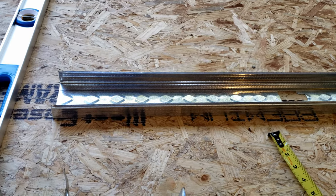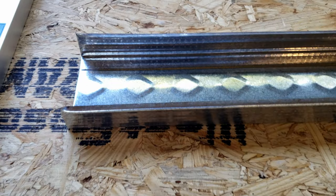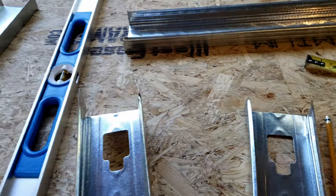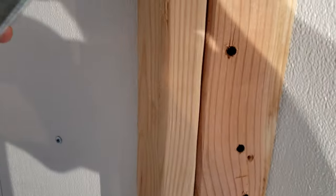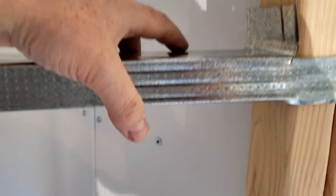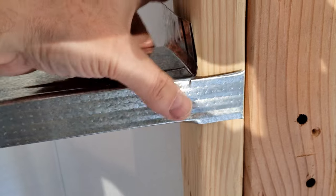What I do is I start with an eight-foot piece of stud, mark it wherever the measurement needs to be with my pencil, then come back and cut it. It's very simple — you just cut it straight down. When I'm done, this is what I have left. Normally they remove this tab, just put the sides on there and then put this piece on. I feel like if I left that tab up there it'd be fine, but I'm just being practical here.